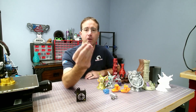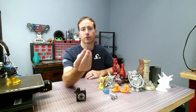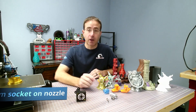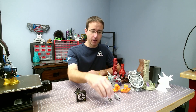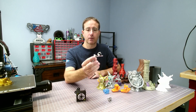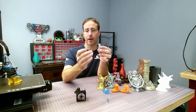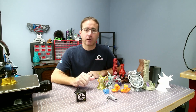When you switch to PETG, you'll switch to the all-metal nozzle. It's really easy to change — you can actually do it cold, just unscrew and screw back in. If you have a little bit of clag built up, you can pop the temperature up to 100°C and it comes out easier. Pros include the non-leaking nozzle design, lightweight build, and there is a V6 adapter that makes this the same length as a normal V6, making it easier to mount into different printers.